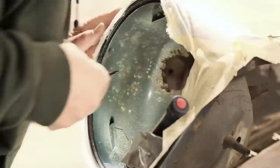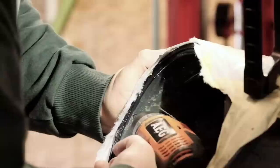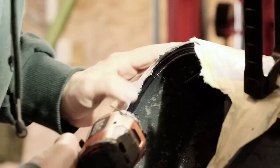Time to turn to the headlight housing. It's a rather common rust damage with G models. Dirt collects between the container of the screen washers and the pot, and if not removed regularly, it builds up a sponge-like lump that, once soaked with water, will stay wet for weeks and eat through the panel.